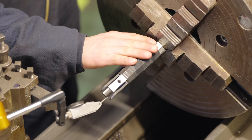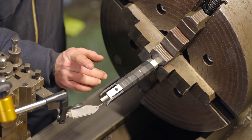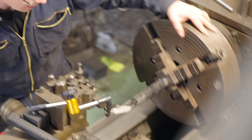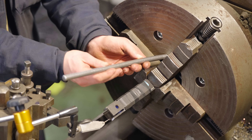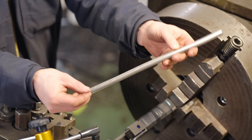Here's what I'm doing to indicate it in. I have electrical taped and masking taped four parallels on here. This is a trick that I definitely learned on YouTube — maybe from Adam Booth, This Old Tony, or Joe Pye. What this does is instead of indicating on the outside, I have a means of indicating on the inside. I take the probe of the indicator and as I rotate, the indicator comes up to the highest point. I can do this on opposite sides as well as on the other side of the rectangle. What I now have is the end of this bar concentric to the spindle of the lathe. What we don't necessarily know is whether this bar is straight to the spindle — it could just be at an angle and happen to spin the tip perfectly on center, which we don't want.